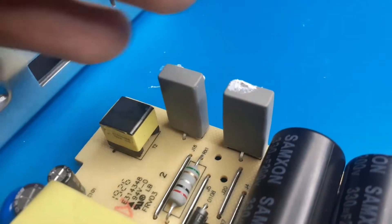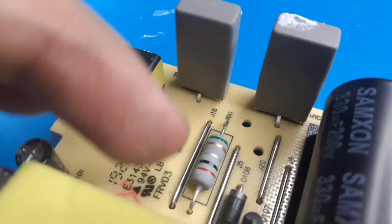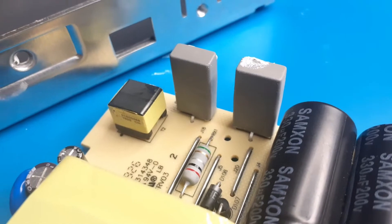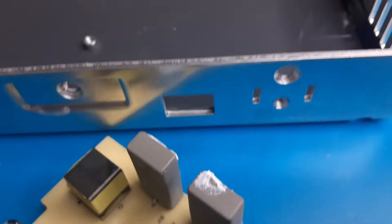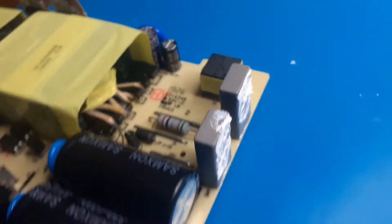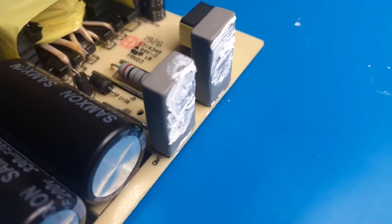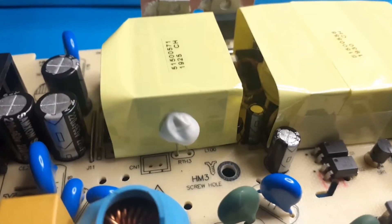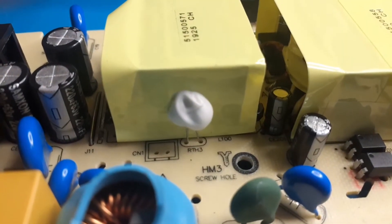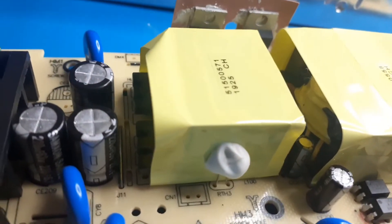The thermal sleeve on the main transistors actually extends all the way up to the legs, so even though you have the metal body you still get isolation from the leg to the metal piece because it covers everything. They are also thermally gunked. There is also a temperature sensor on the main output inductor - possibly an NTC.